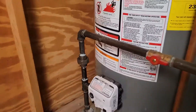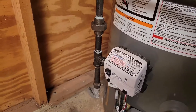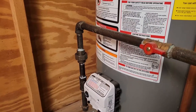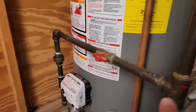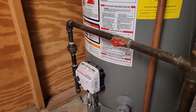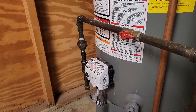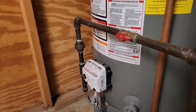Another safety thing: when these are installed, the gas supply should be rigid pipe — hard pipe — all the way in. There are differing opinions on black gas pipe versus galvanized, but I would use the black pipe. We don't want any flexible connection for the gas supply because it can get knocked around. Those flexible lines are pretty thin, and if they're in a traffic area and get hit repeatedly, they could leak. If that leak's not detected and the furnace kicks on, that's when you see houses get leveled — blown up from the basement.